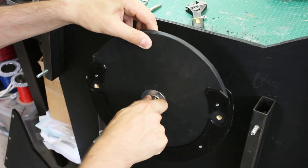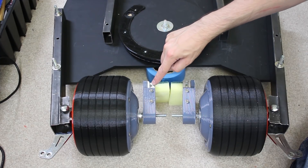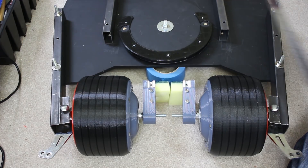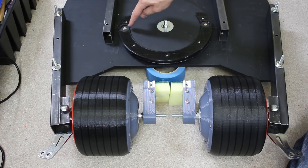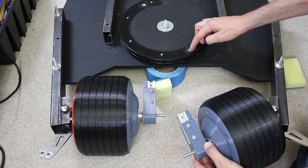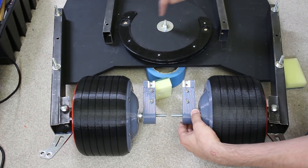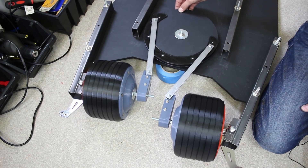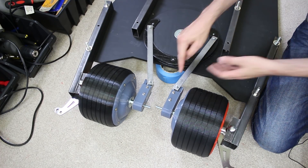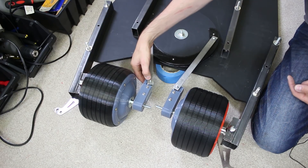That bit of studding is bolted through with some really big washers on each side, making it really strong with no bend between the metal and the wood. I've propped this up upside down to measure between the holes in the aluminum extrusion pieces and the holes here - it looks to be about 240mm on each side. Obviously if the wheels don't track properly I can move those holes further in. As one rod pushes forwards it pushes the wheel forward, and when it comes back it pushes it back. Here's a first go with some rods in - as we move this, the wheels steer. There's some wobble so we'll have a rod underneath, and the parallel rods may be fixed together to stop any flex.